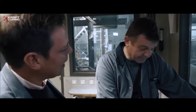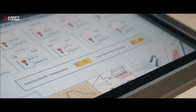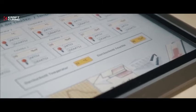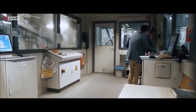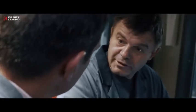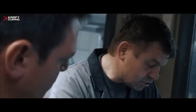I was in the curing chamber. Was it nice and warm? It was very warm. My question: how hot and humid is it inside the curing chamber? At the moment, we are operating at 32 degrees Celsius and a relative humidity equal to 98%. That is high. It is a very good climate for the hardening of concrete pavers. It looks like the system is easy to use — it doesn't need any supervision. It runs automatically. I monitor it every once in a while to check the temperature and if all components are working correctly, but really only a glance every once in a while.